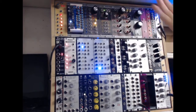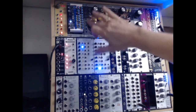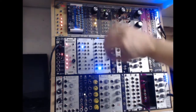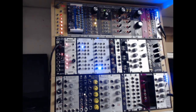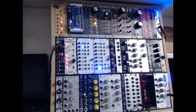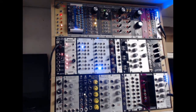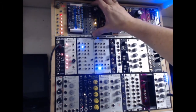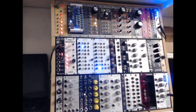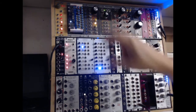It's very much designed as a fun circuit to experiment with, but it works very well here. I'm pairing these with 12 volts, so these are effectively gate outputs giving 12V out — quite hot, but it works well as a gate. There's also a 555 timer for setting the sequence internally, and I've wired it so the signal can either come out or take an external signal in. Because they operate on 12V rails, the clock signal going in also needs to be quite hot.